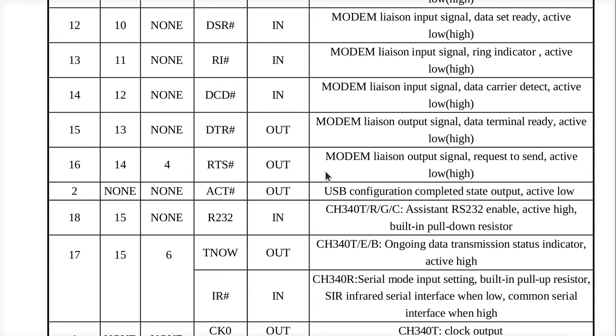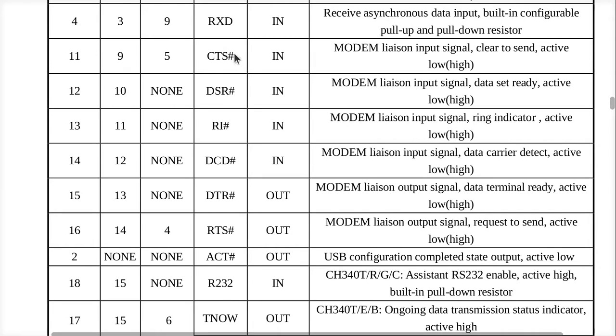In modern PCs - Linux, Windows, Mac OS - there will be enormous buffers. It's the embedded devices I have more concern about on the other end. If we put this CH340 in a little embedded device without a lot of buffering, and the device says it's not ready with CTS not clear, the reaction time of the UART in the CH340 is unknown. If I raise this signal, how long will it take the chip to stop transmitting? That's important with older retro projects like the kind I like to work on.